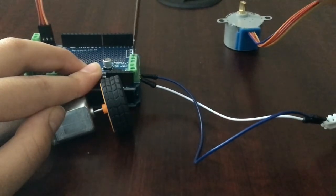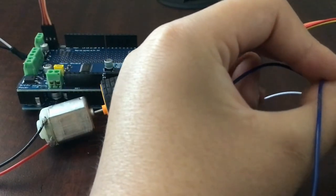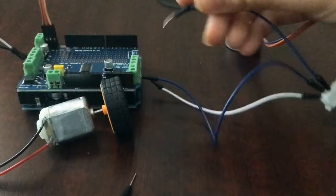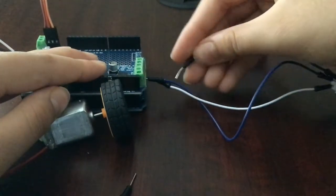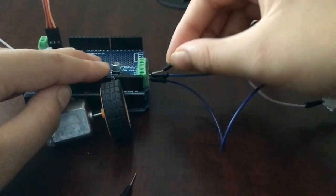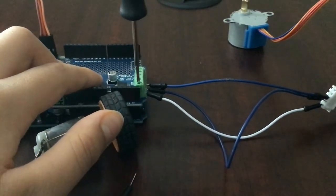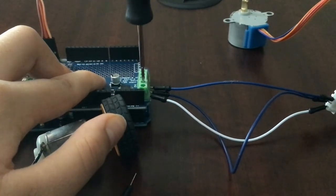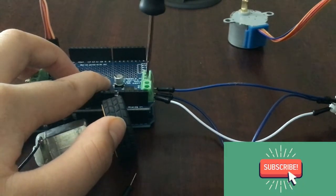You should hear them connecting. This screw terminal is just for securing the wires — you don't really need to screw them in, but it's very good practice. When I first got this I didn't have the screwdriver so I just used it without screwing them on. For your DC motor, I imagine you might be using a 6 to 12 volt motor. To secure everything, let's just screw those down. You don't need soldering iron which makes it much less confusing.